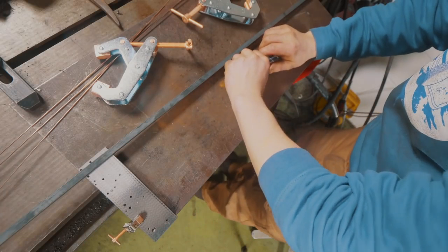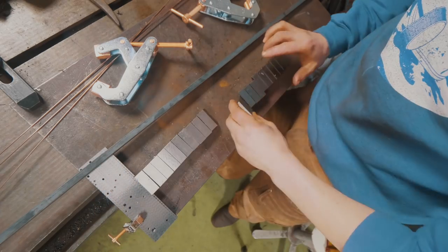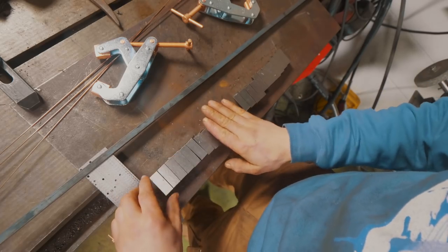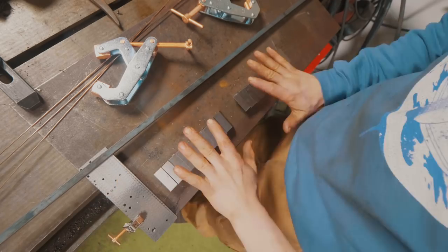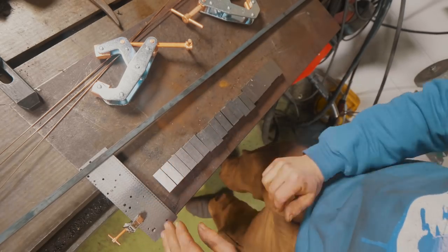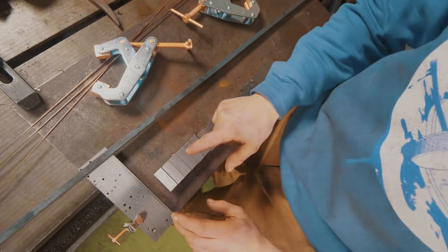So now we have to get ready for welding these things up. We TIG weld them together so they stay together before forge welding. As you can see, there are lots of burrs and general dirt on it, so we're going to file off all the burrs, then flip the pieces around so that the end of the pattern is on the sides, and tack weld it all together. When we do go for the forge weld, this is going to be one of the most difficult tile forge welds I've ever done because it's extremely long, there are loads of pieces, and since we cut to only 16 millimeters, that's not a lot of forge welding we can do. So high risk of failure — but if it works, it's going to make a beautiful pattern.